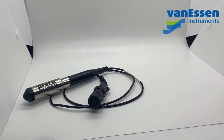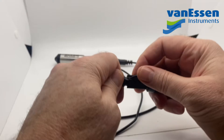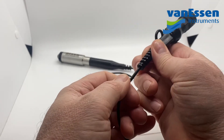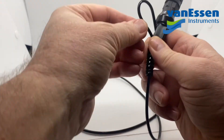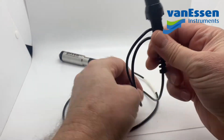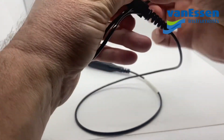So again we'll focus on the DXT version. Being able to adjust these cables is actually quite simple — you'll see that I've already more or less started with a loop here, and that was created by pushing the cable up through the top connector. The nice thing is if you just tie it back to itself this way it creates somewhat of a kink, so we've made it so that it can tie back onto itself without causing that stress point.